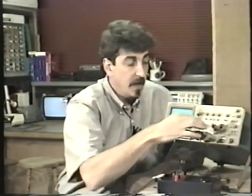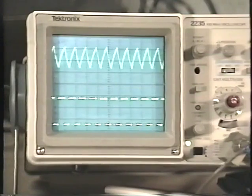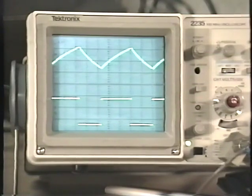And if it's sped up, and I'll show you later on how we speed things up, they seem to move so fast that all we see are 2 continuous lines. When I show you the waveform by flipping the input coupling to, in this case, AC, just to make it convenient, you see the 2 waveforms. If it's slowed down, you can see that what's really happening is first one channel is being drawn and then the other. This is called alternating. And alternating is best when you're viewing fast-changing waveforms.